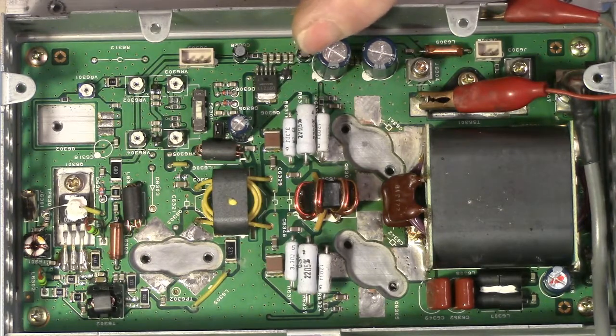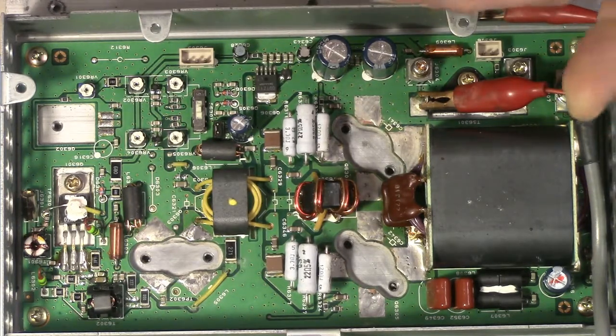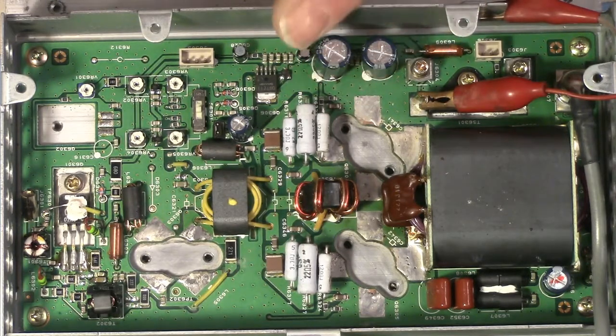This, however, is eliminating that part and replacing it with a more proprietary part. As soon as I saw this switched regulator, I said, oh boy, this is going to be one of those items that, if it goes bad, you're not going to be able to replace it because it's probably discontinued. And sure enough, I looked up the part because I wanted to see what the control voltage requirements were, because I'm going to have to enable this with a control voltage. And sure enough, the part came up discontinued on everybody's website when I looked for the PDF document on the device.